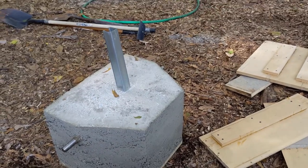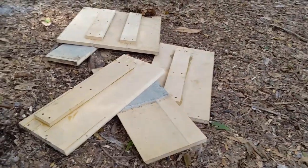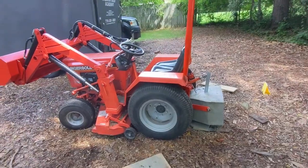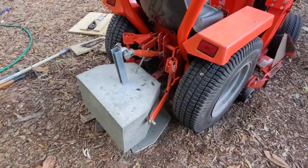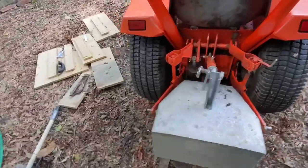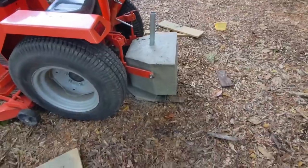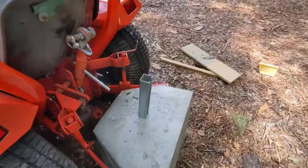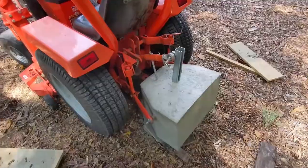It's now been 48 hours and the concrete has set up enough to take the forms off. I did not use a release agent but it was not necessary — the board just fell clean off without the slightest difficulty. There's the counterweight hooked up to the pins for the first time. It's a bit of a pain to install just because you have to navigate the tractor so perfectly aligned to it, but once you're there you just kick those lift arms in place. Looks like we did pretty good with the balance of it — it's sitting more or less level of its own accord. Next we put some ears on here for that to engage to, so that it keeps the weight straight and level.